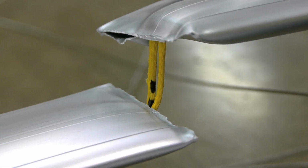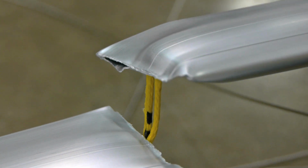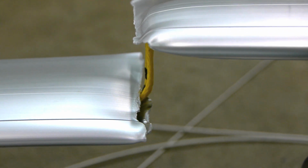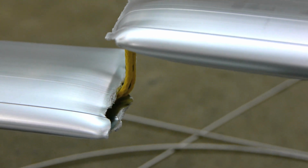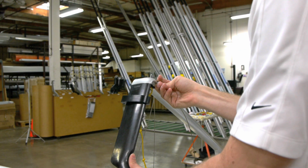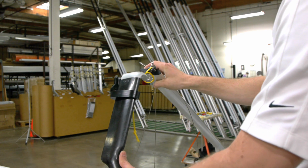If the down tube is crushed at the center of the bend, the first step is to finish breaking the down tube so you have access to the broken ends, and then spread the material to allow the VG rope to pass through the broken areas. Remove the ball lock pin and separate the base tube from the down tube.